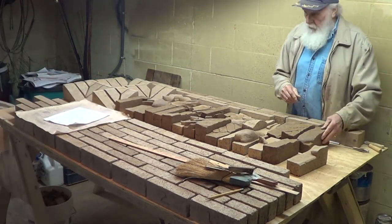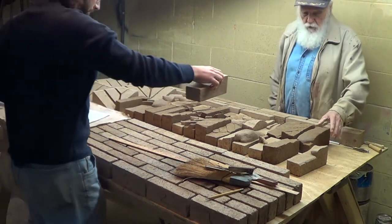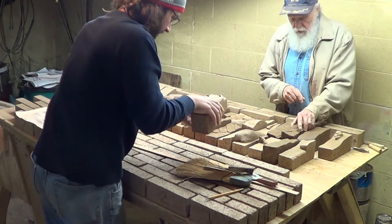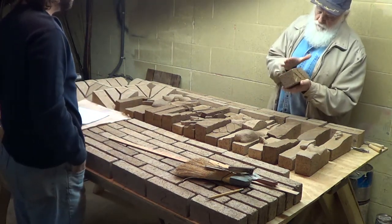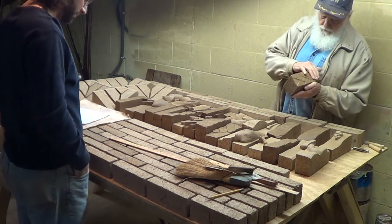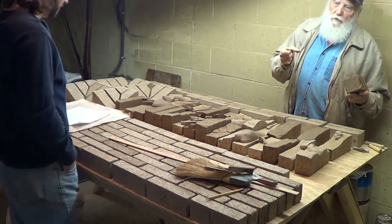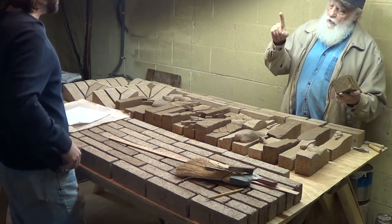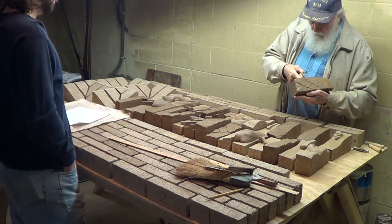I have had occasions where I think the brick might blow up, or there's a good chance of a brick blowing up. Like, for instance, this one here, that's almost a whole brick. I have worried about it, thinking, boy, that brick's awful solid. There's a good chance I'm going to have trouble even drying that thing out, because they'll turn white and you think it's dry, but you feel them, it's still cold. I've taken an electric drill and a wood bit, these long ones, and it beats your thumb, and I've drilled holes through there. And you can do that.